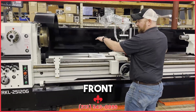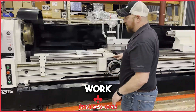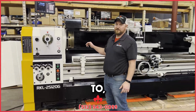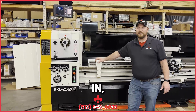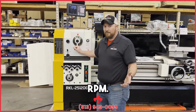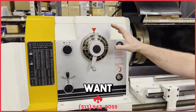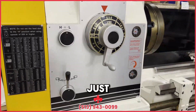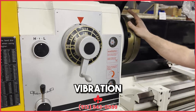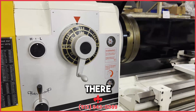You're going to want to work your front to back first. Once you get your front to back where it needs to be, then you can work on your up and down. Another thing I've recently learned: when you get pretty close to getting it dialed in, you want to turn the lathe on to around 600 RPM — this lathe will do 530 — turn it on, let it run, and finish your dialing in. That'll help you find any vibration and just help you get there that much better.